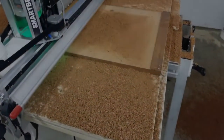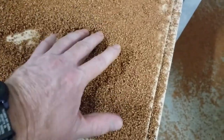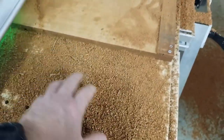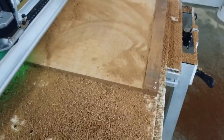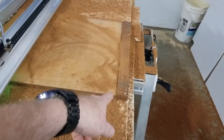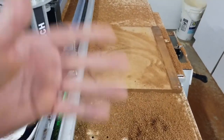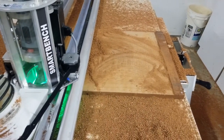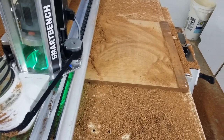It's finished with the surfacing — nice and smooth. That's your chip load — that's what it should look like. If you don't have good chip load you're heating up your tool and dulling your bit. I'll clear this off and use the same origin/datum point and tell it to do the pocketing first, then come back with the 30-degree engraving bit for the date, which is very small.